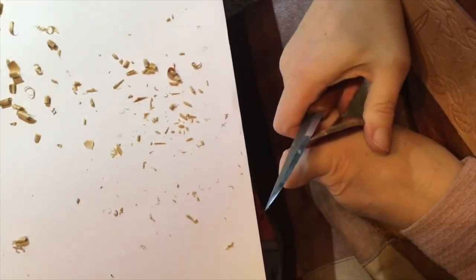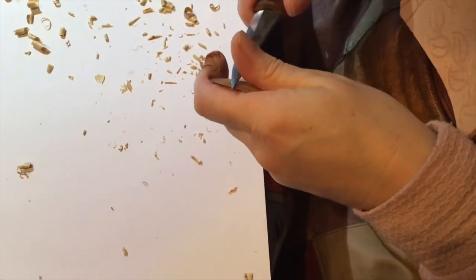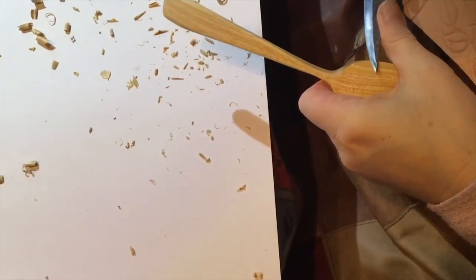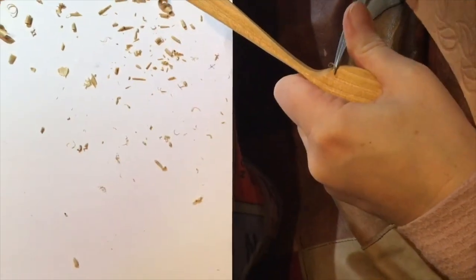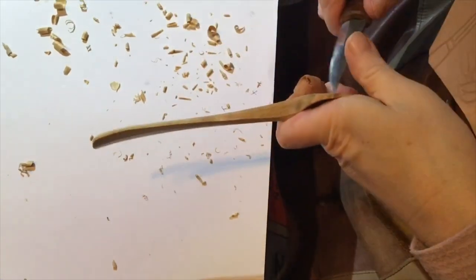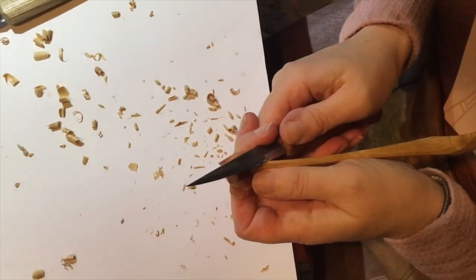But it wouldn't be the first time that I go around doing a second microchamfer over the top of the first microchamfer because I can't remember. And then the microchamfer towards the back of the bowl on the back just starts getting a little bit bigger. So it's less of a microchamfer and more of a chamfer, and then joins in with the one I put on the back of the handle. So you've got something to match up to. That's that done. And I will take one more chamfer just down that sharp corner of the handle.